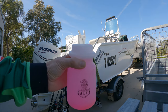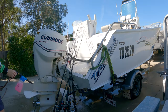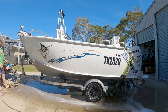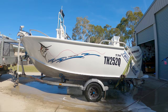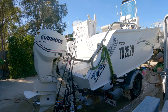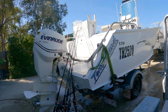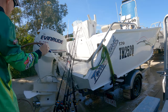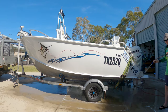This next step is a bit optional, but I find it helps to remove leftover salt crystals. Spray detergent over all the areas, same as with the initial rinse. After that, re-rinse the detergent off — this is essentially the third wash. The initial rinse draws the salts off the surface and washes some of it away.